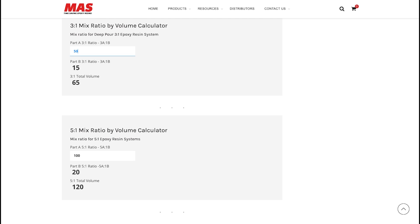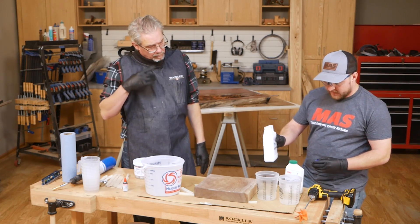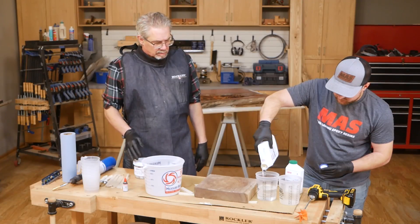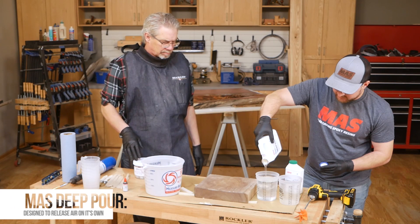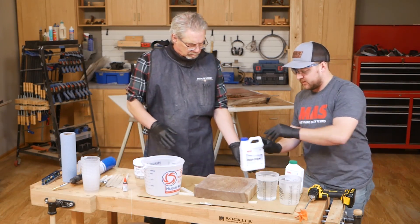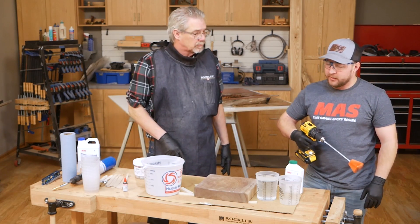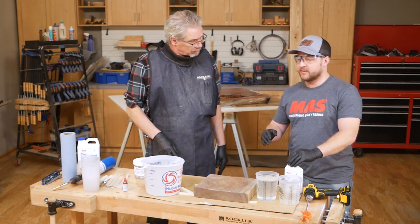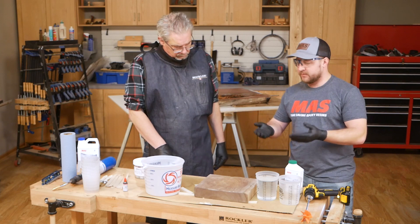We're going to do it by volume when we mix it here — 32 ounces of resin and then 11 ounces of hardener. Do you need to worry about getting bubbles in it at this point? Luckily, with the deep pour system, it self-releases air on its own with the extended working time. With simpler systems like one-to-one or two-to-one, if you mix too fast — say with a power drill — you can whip a ton of air in and it takes a while for those bubbles to release. With the deep pour system, viscosity is so low it has the consistency of water, so when you pour it, all the bubbles rise to the surface and pop on their own.